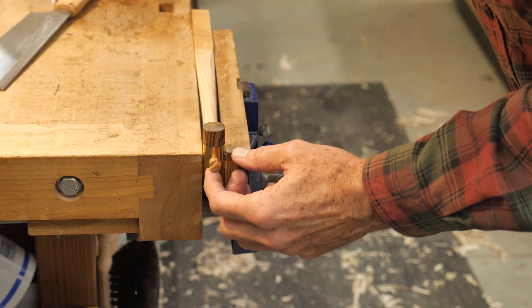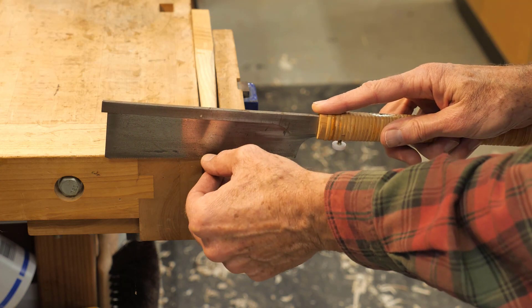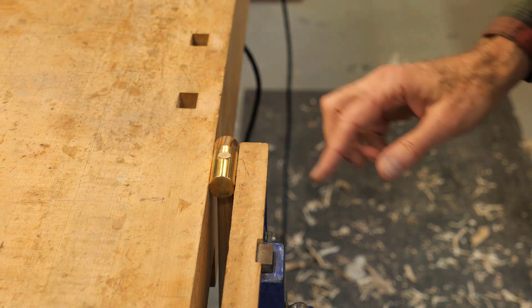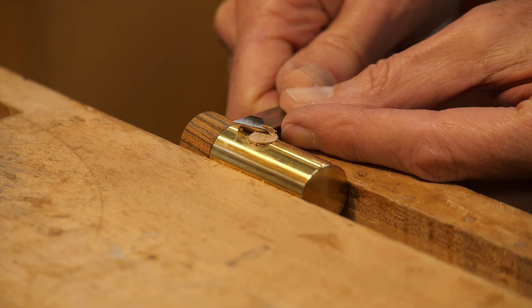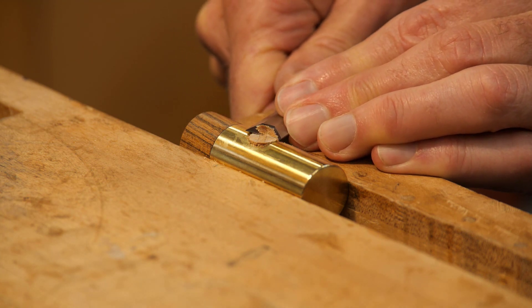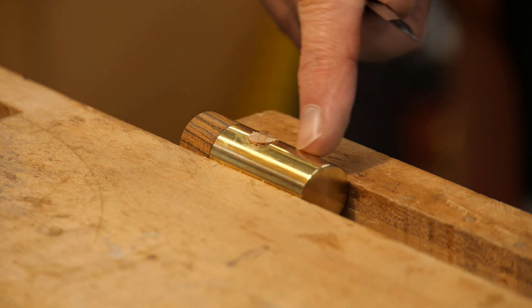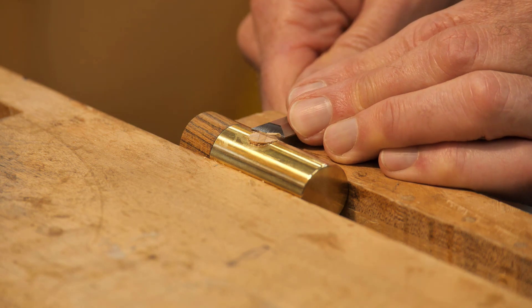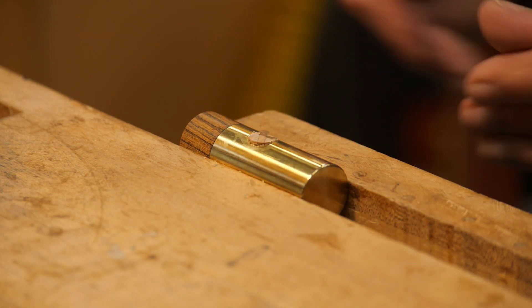The epoxy is dry now. I've got the parts in a vise and I'm going to go ahead and cut off the top of the tenon. I've got the head back in a vise with the end of the tenon facing up. I'm going to use my chisel to clean off the top of the tenon and get it flush. It's a little tricky — you want to take off a little bit at a time. I'm going to come in from either side. You could sand it, but it's hard to sand this because you end up scratching up the brass and getting metallic shavings in that end grain. So I find it's better to very carefully come in and clean this up with a chisel.